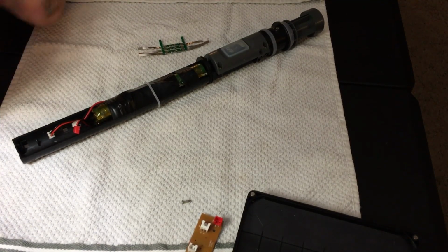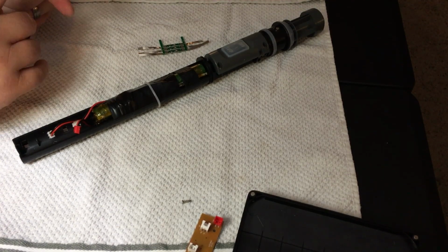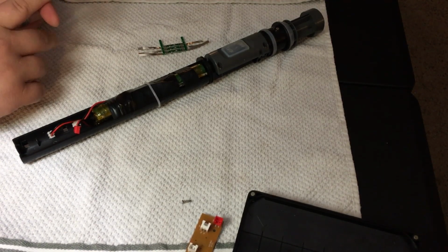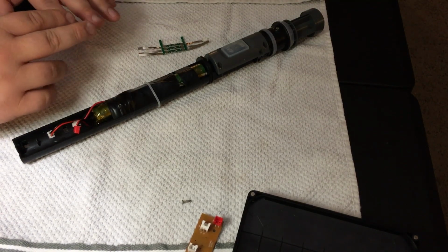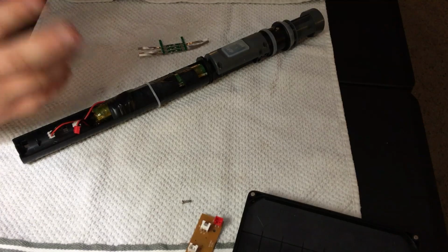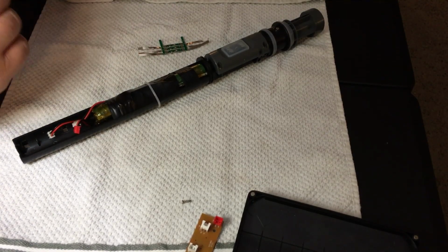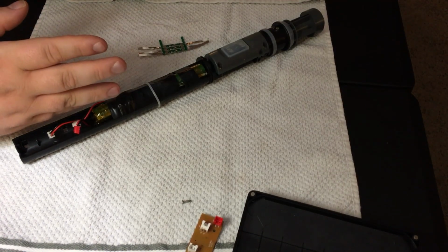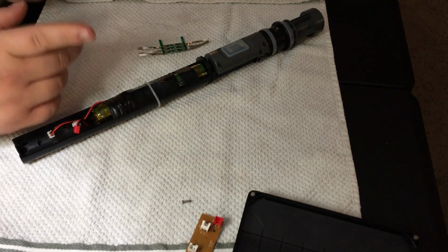Fun fact. Laptop batteries, when they go bad, they don't actually go bad. What happens is usually one cell within the mix goes bad. The onboard brain, so to speak, the controller, the battery management, says, "Hey, this cell is bad. Therefore, this battery is no longer going to charge." That's usually what happens. It's not very often that every cell fails.